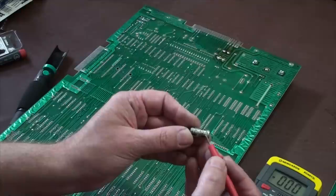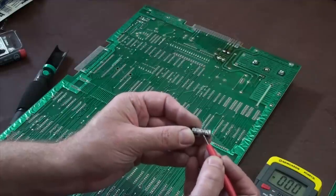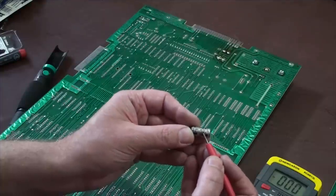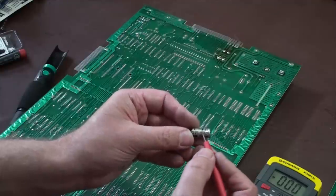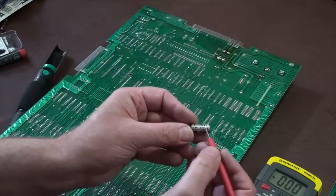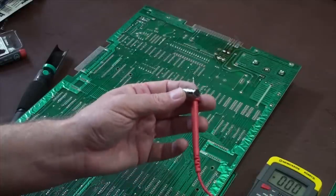So 16 volts, at 470 microfarads. Let's say we go to the local supply place and they don't have any at 16, 470, but they have something that might be at 60 volts at 470. You can use that and it'll be just fine. It just means it has a higher voltage rating. It can just handle more voltage. But the 470 microfarads has to be the same. And you cannot go lower than 16, but you can go higher. Even if it said 1,000 volts, 470, you could use that too, right? But generally, they're going to have stuff like this because this is a common value.